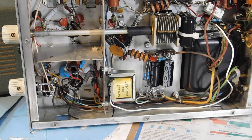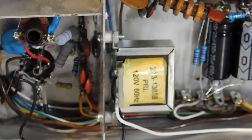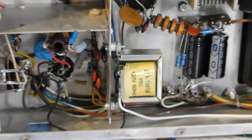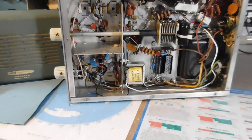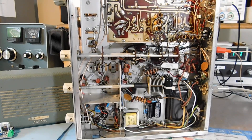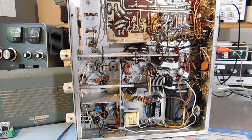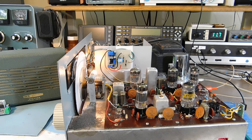For power, I had a small Radio Shack 12-volt transformer that I mounted on that shield right there, and I paralleled the primaries with the regular power transformer, so when you turn the on switch on, everything powers up at once. I'll show you where the rest of the power supply is.